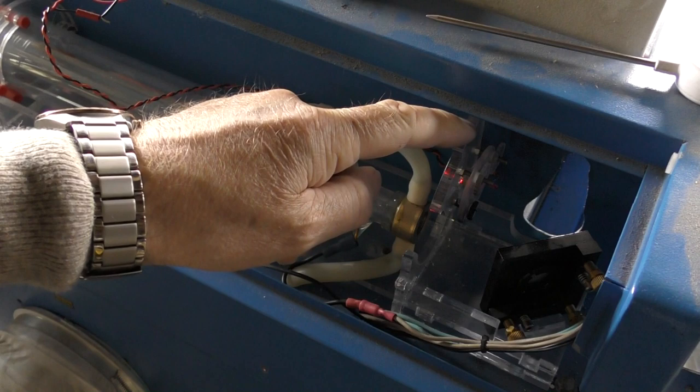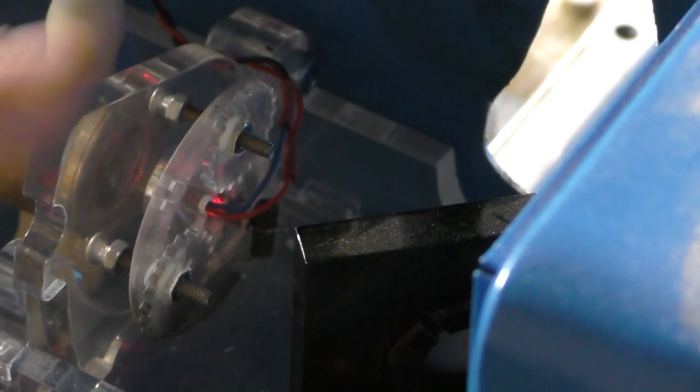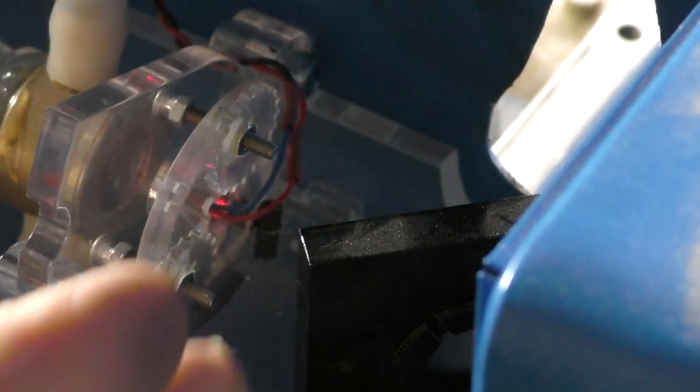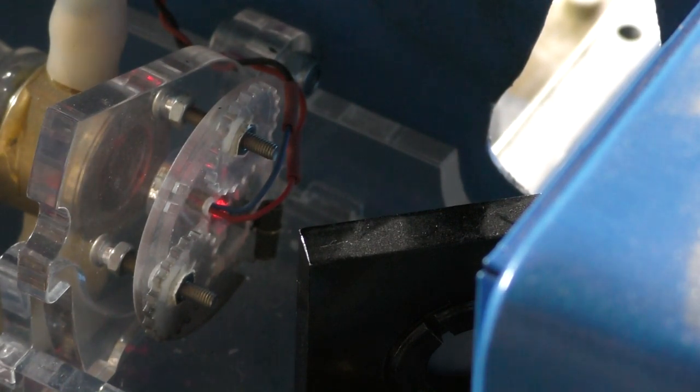Here's the very latest version I tried to include in my system — it's got a little red dot pointer integrated in there, which pulls down hopefully to absolutely true to the vertical and central axis of the tube. It's only made of perspex but it's pretty good in terms of engineering. Even so, I could not get it to work perfectly in the forward direction to set the beam. Although it gets the mirrors roughly there, you still have to go around and carry out the scorch test. So what's the point? You might as well start off with the scorch test and do the job once.